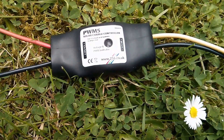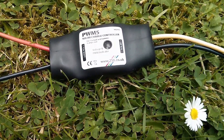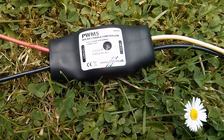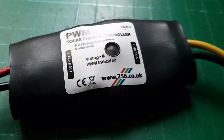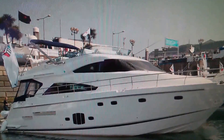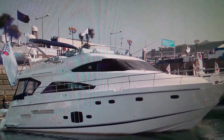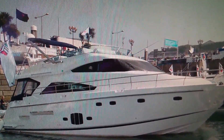What I should say is that I don't believe that equalization belongs in a charge controller — certainly not automatic. It would have to be a manually invoked function where you press a button, and I believe it would need an 'are you sure' and warnings about connected equipment that might get damaged by the high voltage. I just don't think it belongs in a charge controller where it just cuts in every so often. One of the areas where the PWM5 has been popular is in boats because it's completely waterproof. You don't want to take the battery voltage too high because there's probably going to be two or three grand's worth of navigation equipment on a boat like that, and you don't want to be responsible for frying it.